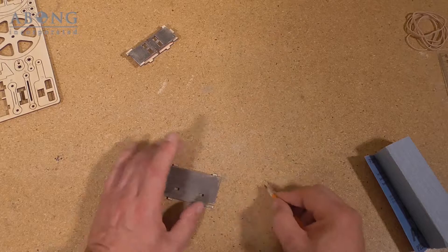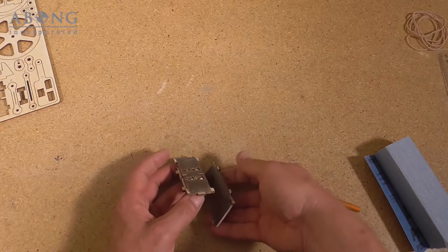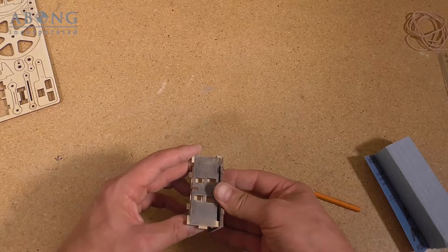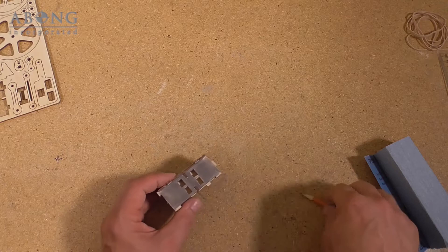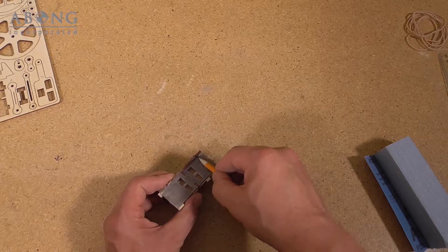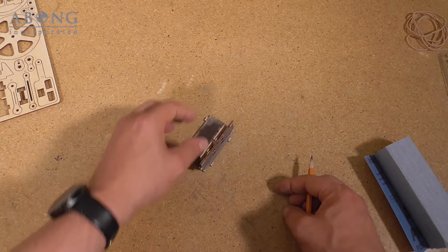That's a good coat right there. Now we're going to take this valve plate port assembly — the valve ports just pop right onto here, and it's only going to fit one way. There's no glue; we're trying to keep glue away from any of the parts that are going to be sliding or moving. Anytime you think you can add a little bit more graphite, go ahead and do that. We'll set that aside for a few minutes.